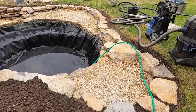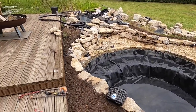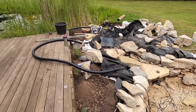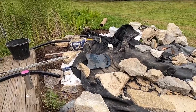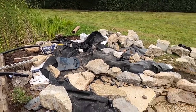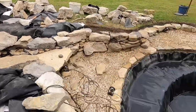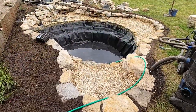The pond is empty, drained and cleaned, and this is going to be the last fill. I'm making progress on building the stream - I'm just working my way back to the second spillstone now. It's tricky because I'm being governed by the water level on the pond behind it, which dictates the level of all the spills. Normally I can take my levels from the level of the pond and work my way up, but here I have to work with two different levels - the level of the pond down here and the level of the pond up here.